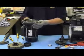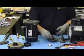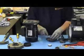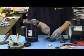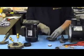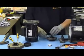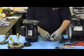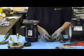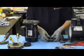Now we have to change the other half of the seal in the impeller. So we gently and carefully remove the old seal — this is the other half, the ceramic part. Set that to one side. We refit the new other half, the ceramic shiny part, onto the impeller just by pressing it in carefully.